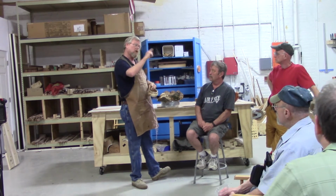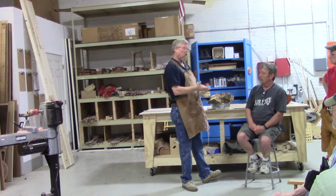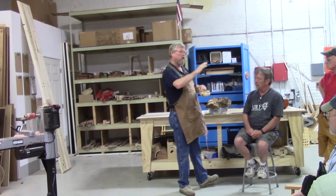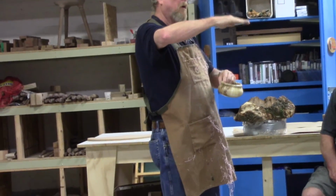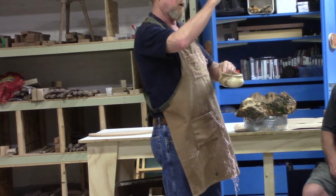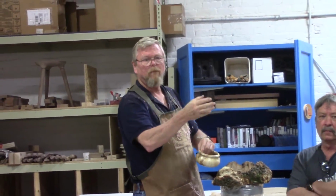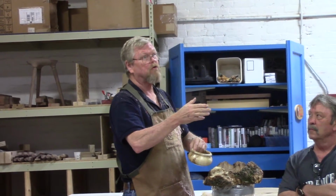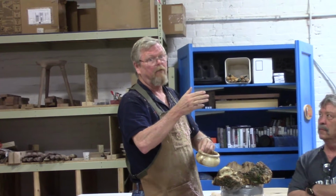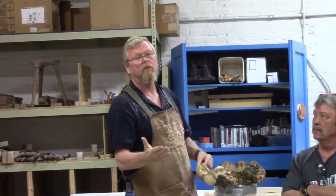Like I said, you have to be careful, because when you start pulling that vacuum, it's going to bubble up, and you have to manipulate that valve, open and close it, until it settles down. You have a gauge for atmospheric pressure. It's usually 25 inches of mercury. Mine goes to 29 and a half with my pump. You need 25. 30 is the tops.